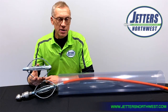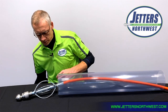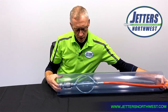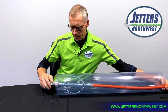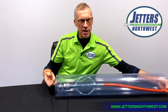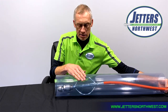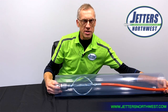The fancier type of nozzle extension we call a centralizer or centralizer skid. Using this six-inch pipe as an example — a lot of root intrusion comes in from the top of the pipe — this brings a rotating head root cutter nozzle into the middle of the pipe so the water jets hit the top of the pipe harder. And if you're doing reline prep, wanting to scour the entire inside of the pipe, these centralizer skids are really nice for a more 360-degree cleaning.